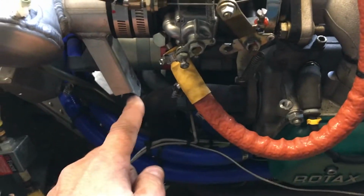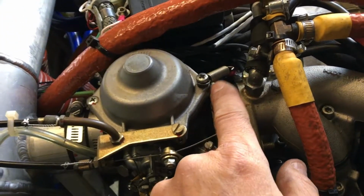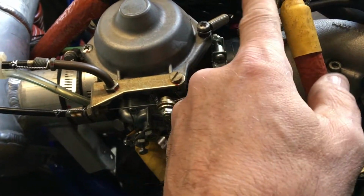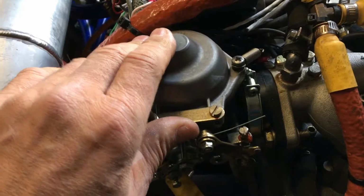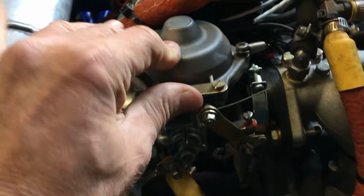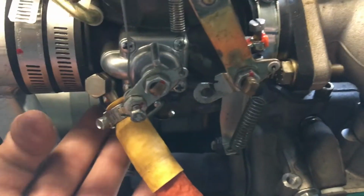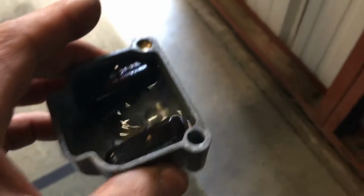Okay, so we've got the spill plate removed and tucked away out of the way, and then I removed the spring off of this fitting forward on the crossover tube. And then I loosened up both of these boot screws. So that should loosen up the carburetor. Now you're going to see that's about all you get. I just got barely a little twist out of it, but that's good enough. I'll take it. The other thing I've gone ahead and done is I've removed the bowl here. Let's take it out and we'll inspect it with the fuel outside and let you see.